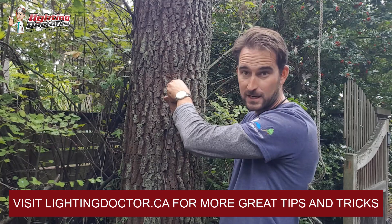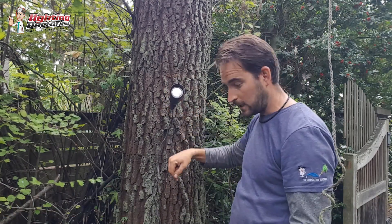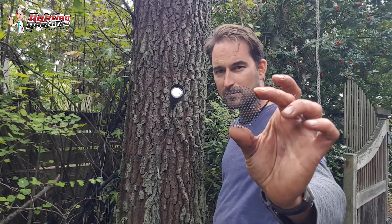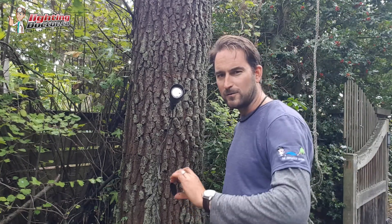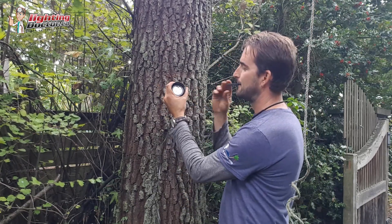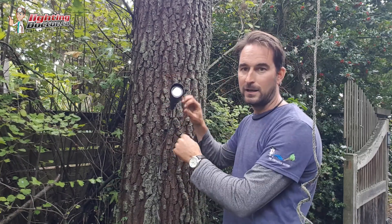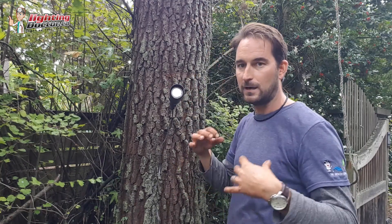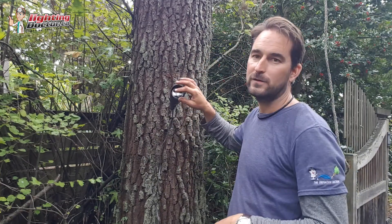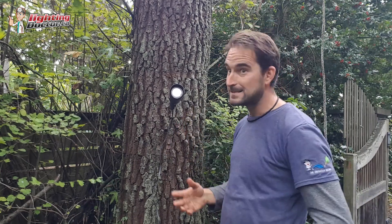I don't have this all the way in so it won't be super steady, but it'll give you the right idea. Then you just make your adjustments and shine it down. One thing I will say is anytime you're doing downlighting, you want to get one of these hex baffles — this little honeycomb-shaped filter. It goes underneath the lens, and when the light is shining down it helps deflect the glare. With downlights shining down, if you walk right under it or in the proximity, it can shine right in your eye; this helps deflect that so it's not as bright.